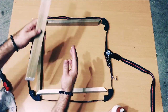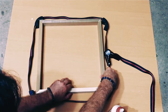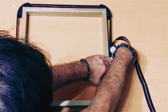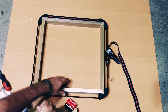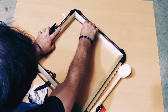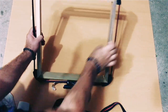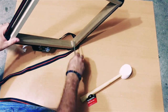Don't forget the other side. You'll want as much pressure on the clamp as you can get and let it set up overnight. If the corners are misaligned, be sure to make the minor adjustments necessary. Here's what the tension on my clamp sounded like, to give you an idea of how tight it was. Use the screwdriver and damp rag to clean up any spilled glue or squeeze out as much as possible.